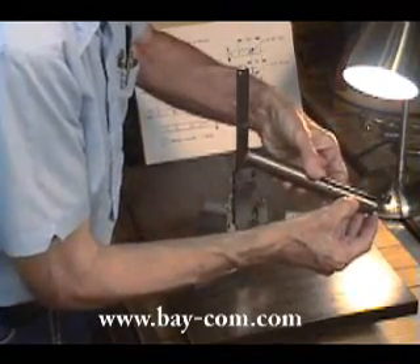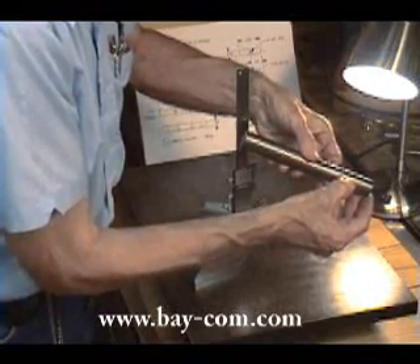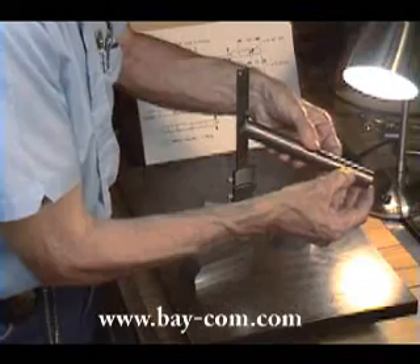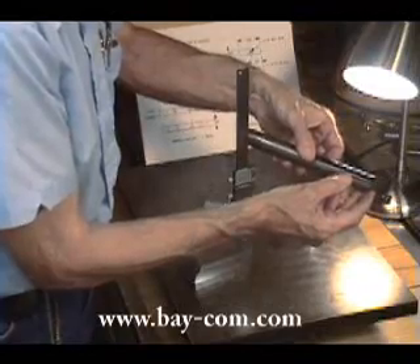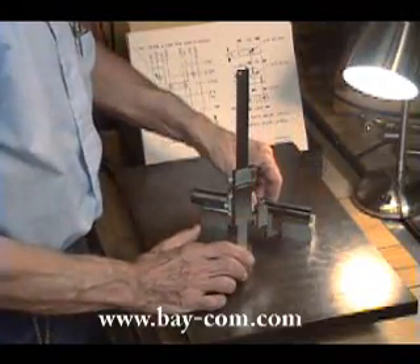I can show each edge. And when I cut this, I can cut a keyway which is exactly 60 thousandths of an inch wide. Of course, it could be set for 1/8 of an inch, 3/16, or whatever key dimension I happen to be using. This is the way you can handle cylindrical surfaces and place your dimensions on them just as accurately as all of the other layout work you've done so far.